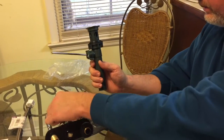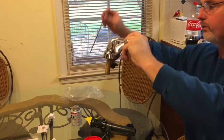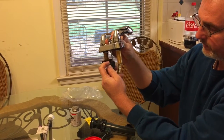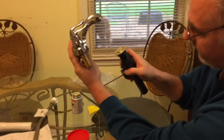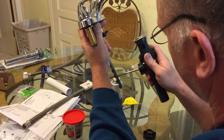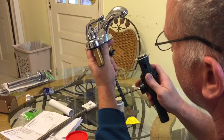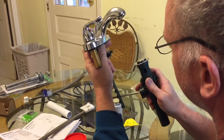From the bottom of your fixture, this rod will go down through here. This piece will shove onto the rod and you can make an adjustment. When you get it set like you want it, tighten up this little nut. This piece goes into one of these holes — whichever one lines up for you. When you pull up and down on the rod it moves back and forth, and the little spring clip keeps it from sliding too far one way or another. That's how that little mechanism works — sometimes that's the trickiest part about installing a new faucet.